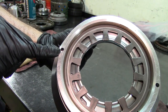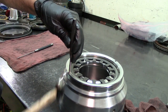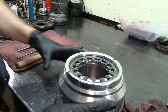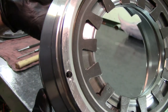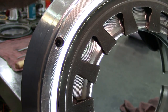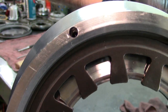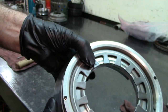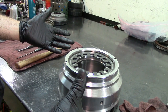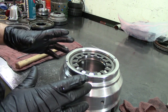I'm going to get my punch and go sideways a little bit, do one side - that works pretty well. I'm going to rotate so you can see. I have already staked this cup plug so it's already staked in place. This is actually the fix I've been doing with this piston. You can put the new filter in there - some kits do come with it, but most overhaul kits do not come with this filter.